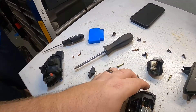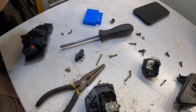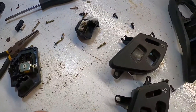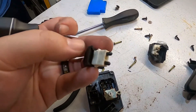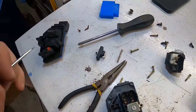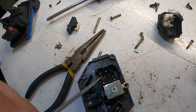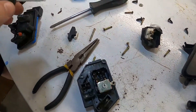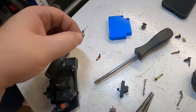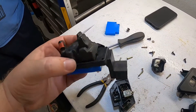So what I did was, these rocker switches — you see these little rockers in here? When you move the switch, one goes to one connection and one goes to the other. These are spring-loaded little switches that press in, and they roll up and push down. The reason why we had up but not down was because when these were pushing down the other way, it wasn't making good contact. So I switched out the rockers — these ones look a little corroded, all burnt on the back side. It wasn't making a good connection, so I swapped it out with the rocker from the other switch. Now we have one good switch that works everything.